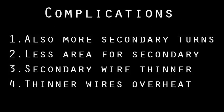The trade-off is generally beneficial, so I suggest you add extra turns if you have the ability. Otherwise, this is one of those situations where you might want to put the shunts back in between the coils. They kind of compensate for it in a different and inferior way.